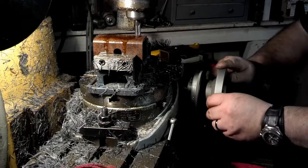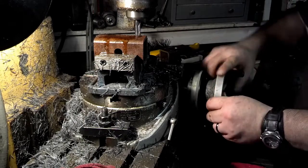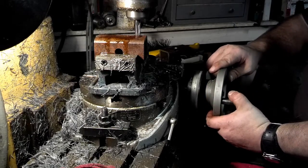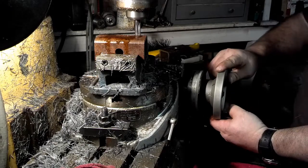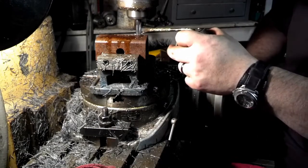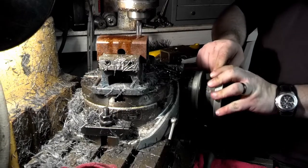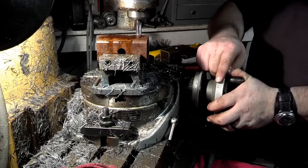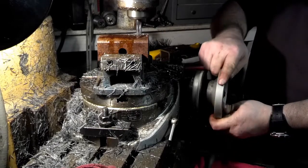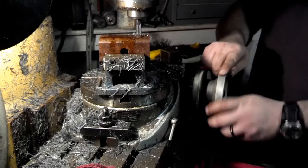So right now we're doing a pretty good depth because we're trying to cut through the side as well. A half inch high speed steel coated rougher. Roughers make little chips. They seem to use less horsepower too.